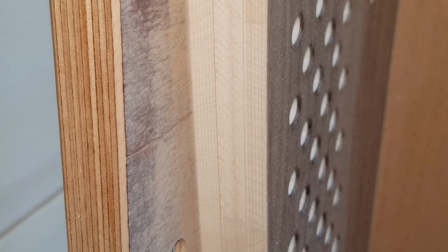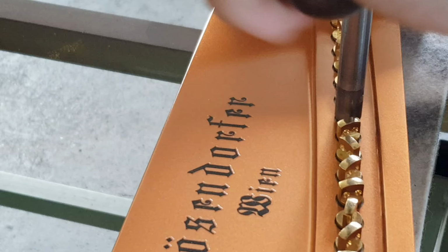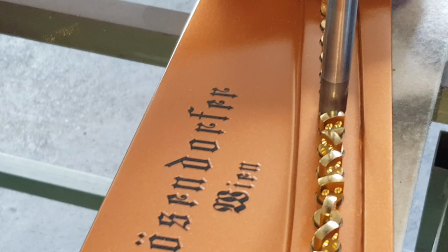You can see the laminates, but the rest plank we'll just move over to slowly, and you can see the beautiful construction here. Again, we've got spruce, we've got red beech for where things need to be attached, and now we're zeroing in on the rest plank, and you can see that there is some laminate there, so I'm not quite sure whether we videoed that earlier, but you can see there's the laminate for the bottom of the rest plank, but here we have maple, and very much like Canadian rock maple rest plank, and it's a beautiful construction. And this is how the agraffes are put on in the next section now, so they can be turned.